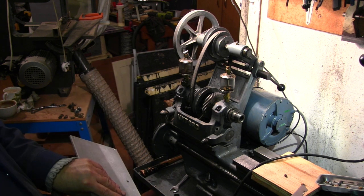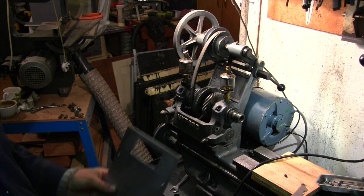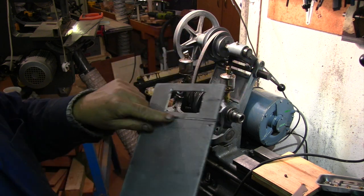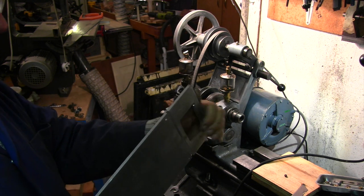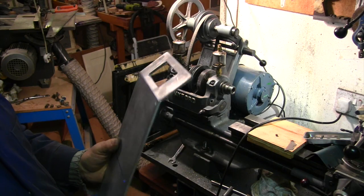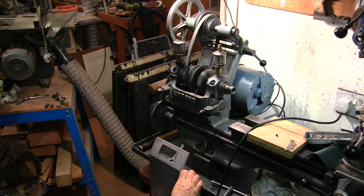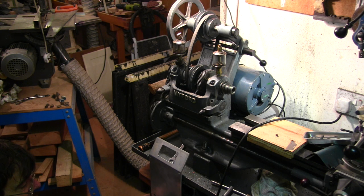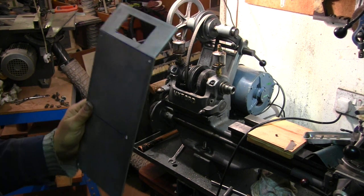This is pretty much made. I'm just going to score the back of it and bend that over slightly so that's going on somewhere about there. I've just scored the plate at the back — just ran it over the top of my table saw. Don't do the blade a lot of good, but I'm just going to stick it in the vice now and bend it over a little bit just so it's got a little bend on it. Now that fits on there like that. I'm going to place the controller there — just going to give that a spray, undercoat it, prime it, let that dry, and bolt it on and put the controller on there.